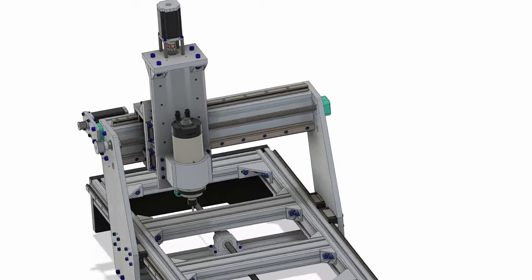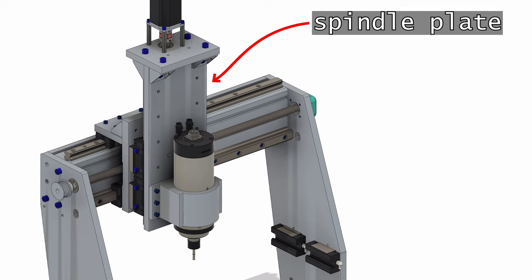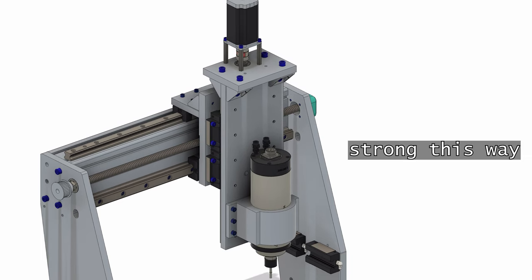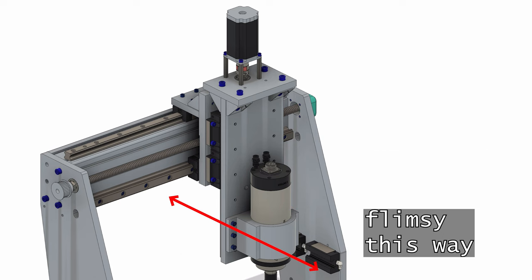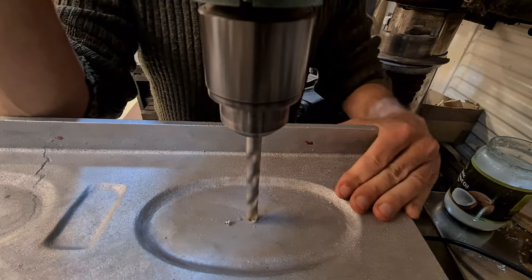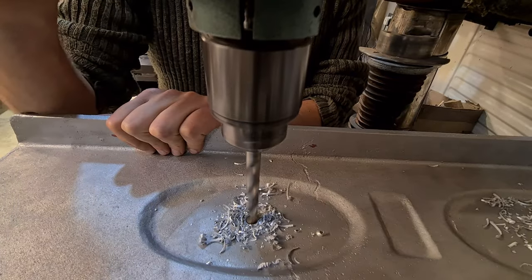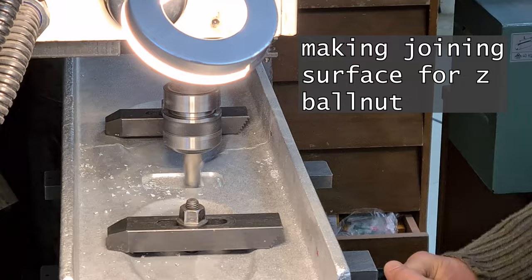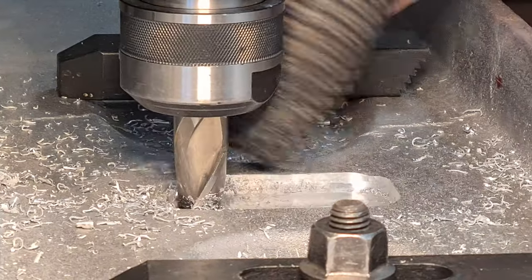Let's have a look at the design of a typical spindle plate. It's commonly a single thick sheet of pre-machined aluminium. Because of its geometry it's quite strong in one direction but very prone to deflection in the other. Indeed many designs could be improved greatly just by adding some perpendicular reinforcement. The longer the spindle plate is, or the more Z travel you're having on your machine, the more this will tend to flex and the more important those reinforcing bits will be.